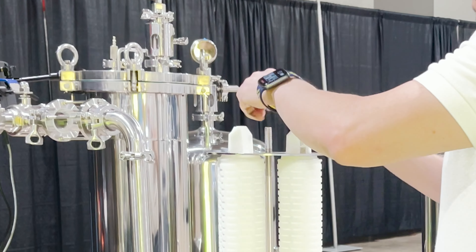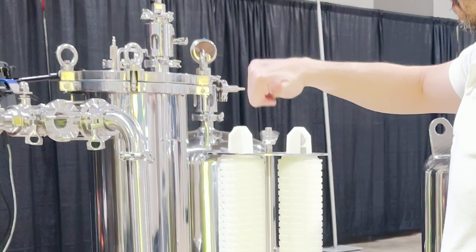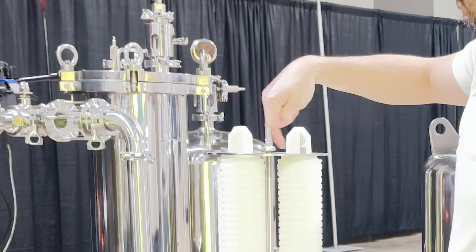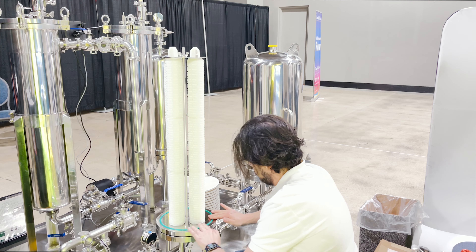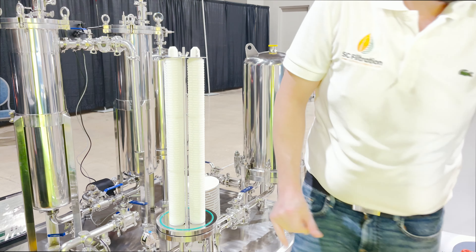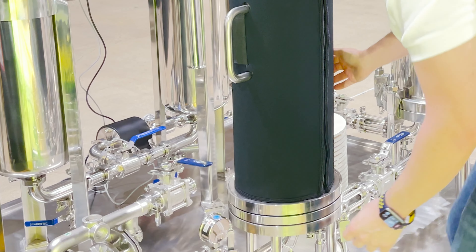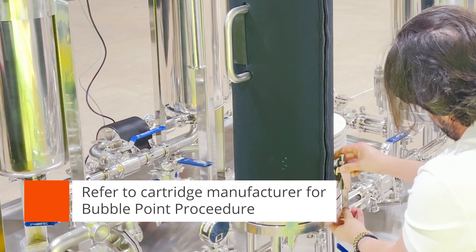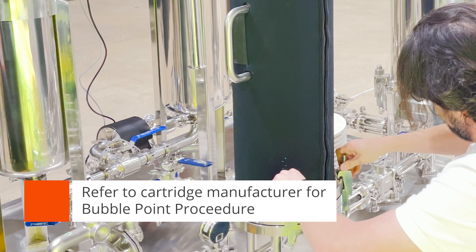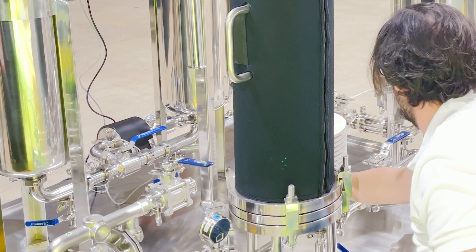Return the plate on top and secure it with a wing nut — hand tight only, since the cartridge is already locked at the bottom. These cartridges are great for capturing carbon or even sterilization. The reassembly is straightforward: make sure everything is clean, the gasket is in good condition and lubricated, carefully place your housing back over the base, and bolt it back in place alternating the bolts. For this type of cartridge, there is an integrity test called bubble point, where using compressed air you can identify whether there is a leak. Reference your user manual on how to conduct a bubble point test.